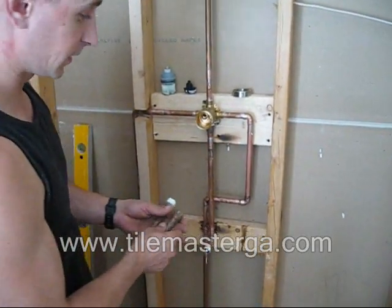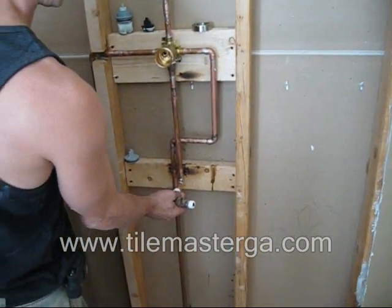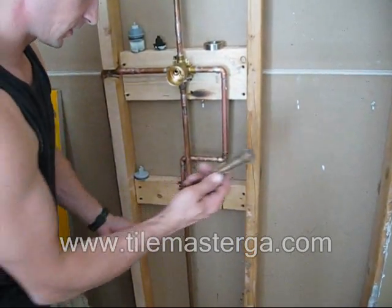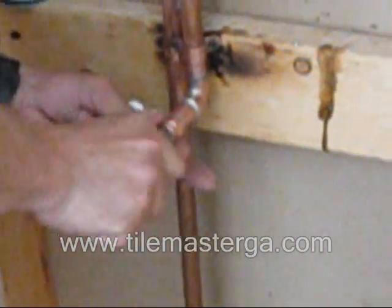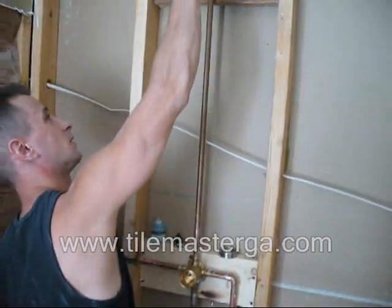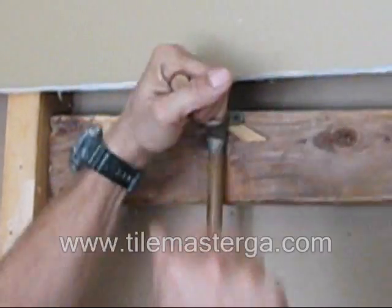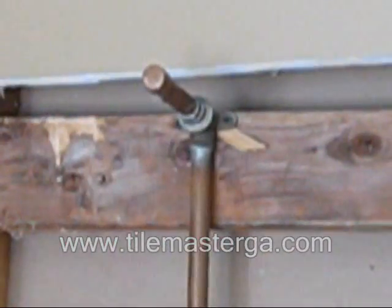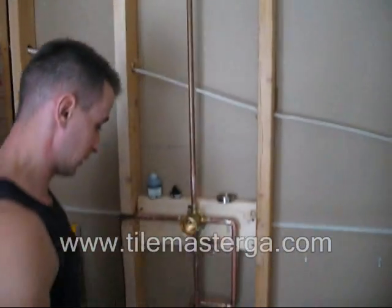We're preparing right now to do the water test. Of course, to do the water pressure test, we have to make sure that all the water lines are closed, so we test the joints, because this is our goal. For the faucet, I have this temporary cap that I'm screwing on. Here we have a Teflon tape. I'm going to use it here to make sure that there's no leak. Same thing regarding the shower. I'm not putting any fixtures just yet. Basically only this piece to make sure it will hold the pressure, because we have all the connections here and we have to make sure that there's no hole before covering the wall with a board and later with a tile.